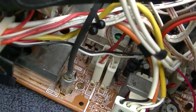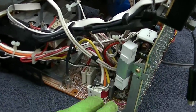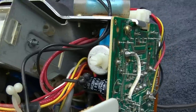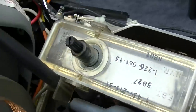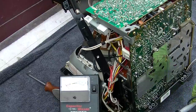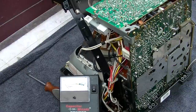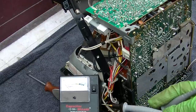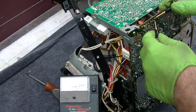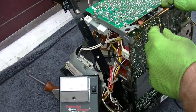We'll test some of these on the bottom board. It looks like the deflection boards are back here, the IF and video processing, and power supplies are down on the bottom. Here's the flyback. This uses SCR deflection. We've got two 4.7µF at 160V caps right here and these are notorious for going open in these sets. This thing is designed to test them in-circuit — the testing voltage is so low it won't trigger anything else. Well, that one's unexpectedly good. That one's unexpectedly good too.